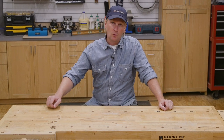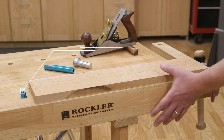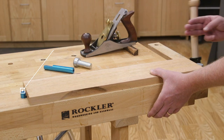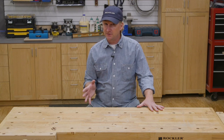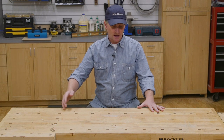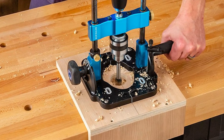Next, let's talk about these holes you see in many workbenches. These are dog or holdfast holes. They're intended to hold bench dogs, which are stops that hold a workpiece in line with the vise. They can also be used with holdfasts, which hold workpieces securely on the work surface. These are both useful tools, so if your bench doesn't have any dog holes, consider drilling some in line with the vise or in any area where you typically secure workpieces.